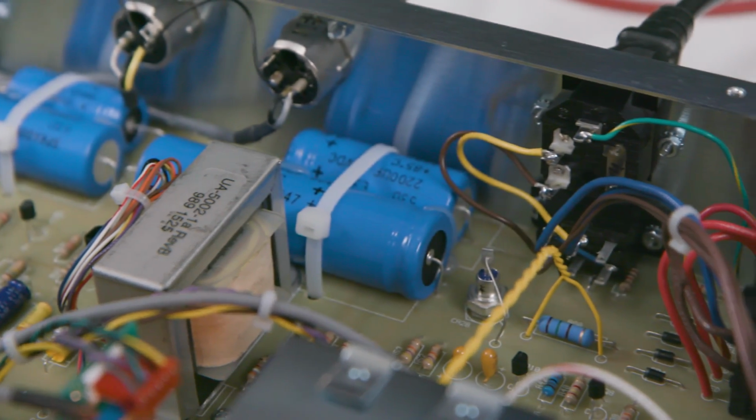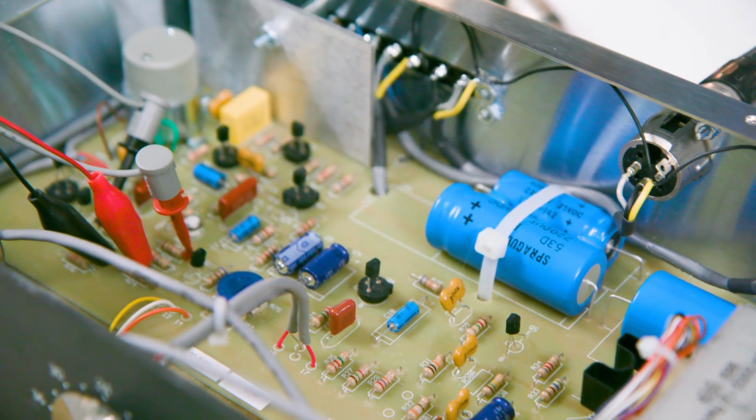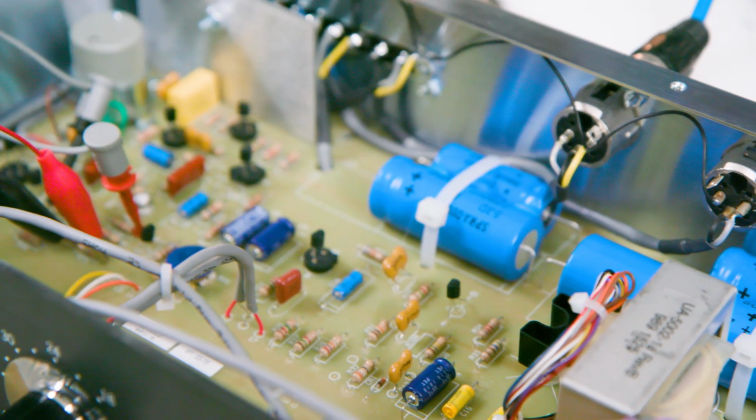And in fact, the transformer design, it's pretty crazy. My dad designed the transformer. And I don't know that it's even a good design, because it was hard to manufacture and it was really tricky. It was one of these things where we'd find things that weren't documented, like, oh, this is really a problem. But if I was going to try to mellow out or stabilize the output stage, I would put a resistor right here. Oh, there's a pad for a resistor on the circuit board that isn't on the schematic. So we'd find things like that that were just accidents.